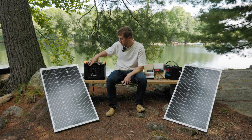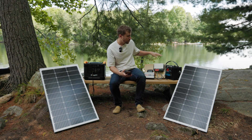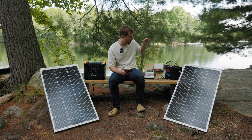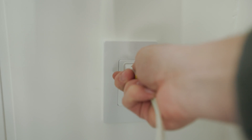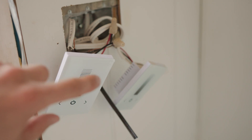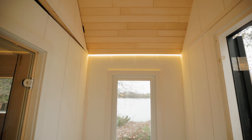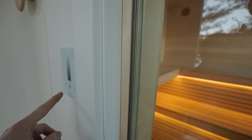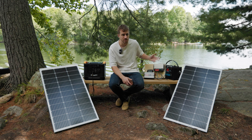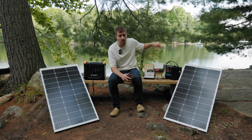With the hardwired solution you can design it how you need it. Other than the slightly cheaper cost, the biggest benefit is that it's hardwired — you can wire it basically like any household item. We have it running LED lights in both our outhouse and our sauna, wired in with light switches. We actually wired both buildings with conventional house wiring so we could convert to AC if we ever get services out here. You walk in, flick a light switch, and the lights turn on — everything feels like a serviced property but it's really just running off 12 volts, low-voltage lighting.